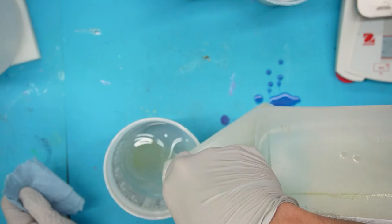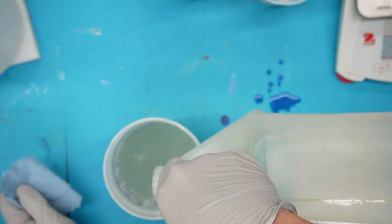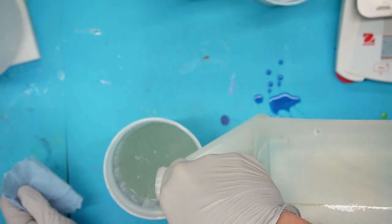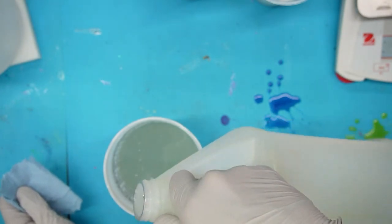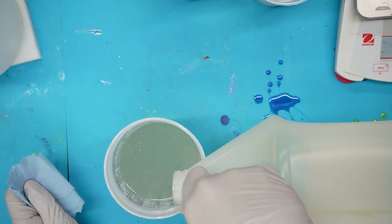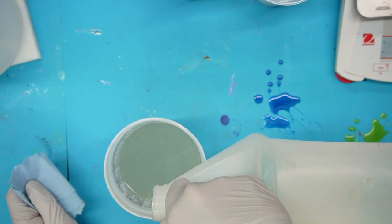of a, when you're doing a river table, the tack free time is a little bit different than a demold time for casting, but generally you're going to want to wait for most things like 24 hours. And I'm not talking overnight, I'm talking 24 hours.